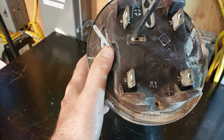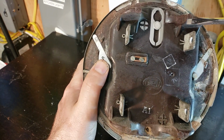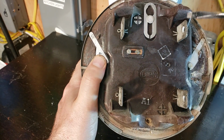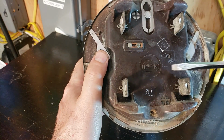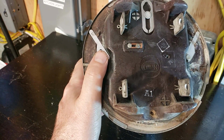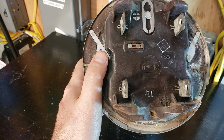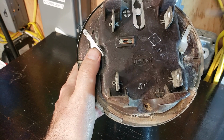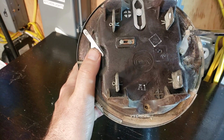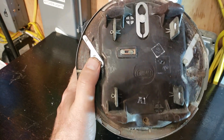Okay, so for those of you who don't know, the power comes in, there's 2 hot legs from the utility. That's on top, and it goes through the meter and comes out at the bottom to your house. This is what your house plugs into. There are only 2 hots, there's a neutral, it's the return, but there's no ground. You ground your house into the ground. So there's 3 wires coming from the utility.